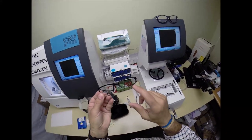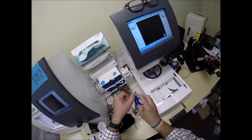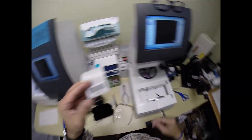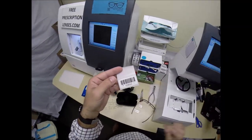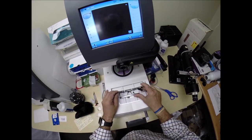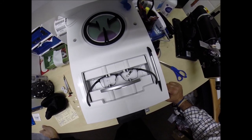Let's go ahead and begin. I'm going to take out your original demo lenses, one of which says Oakley. And let's go ahead and program your shape into the computer. You're going to be Secret Agent 693. We'll put the frame in the tracing element of the blocker and hit start. A little stylus is going to pop up and go around and trace the inside bevel of the right side of the frame before doing exactly the same thing on the left.